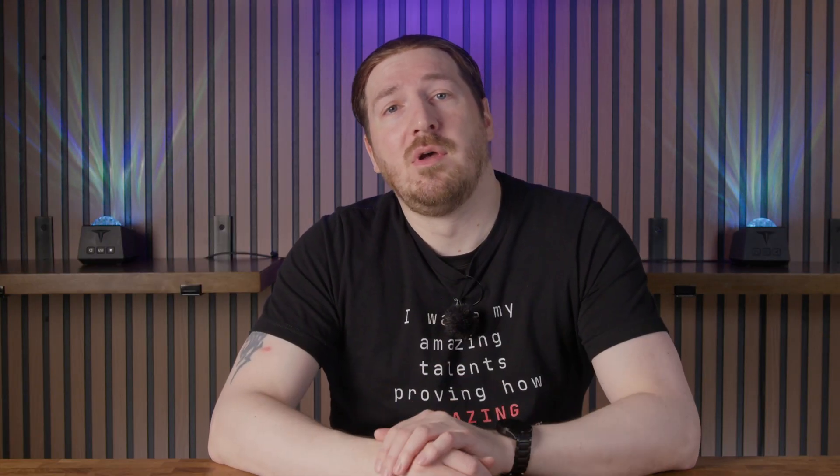For each location with a wired device, we'll have a premises run — a solid-core Cat 6A cable that runs back to the equipment rack. On the patch panel side it'll be terminated with a keystone jack, and on the device side it'll be terminated with a coupler. A patch cable connects the keystone to the switch, and another patch cable connects the device to the cable run, so once the cable is installed in the wall, we shouldn't ever have to touch or disturb it. In bedrooms, work rooms, and other areas, we'll have a run that connects to a Ubiquiti Flex switch — a 5-port PoE switch powered remotely from our rack equipment — providing additional connectivity for laptops, desktops, printers, or anything else connecting via ethernet.